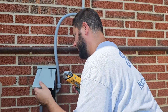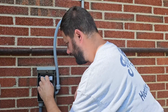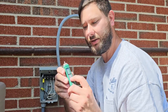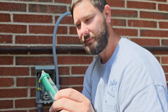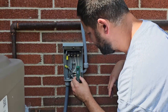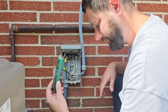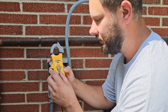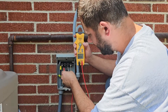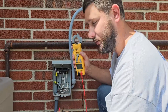We're going to take the front cover off the disconnect. Sometimes you can take this cover off, then take the plug out and the cover out. We can turn on our voltage detector and go straight to the line — and it looks like we have voltage. We don't have voltage over here to the load, but we have voltage coming in. Or we can take our multimeter, turn it to volts AC, take our two leads and connect them to the two wires coming into the disconnect. You can see right there we have 245 volts, so we need to turn the breaker off.